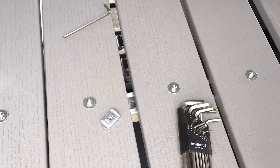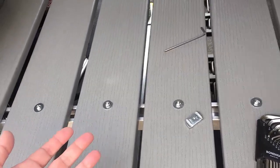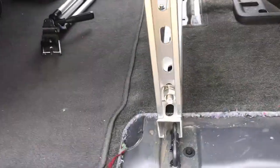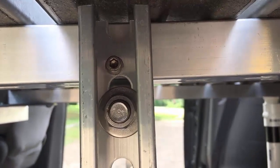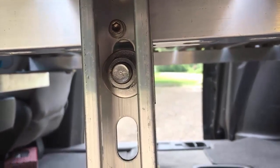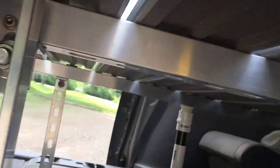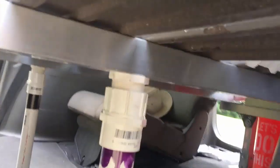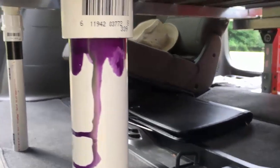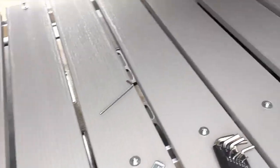You would just set these boards down in place and then tighten the bolts — easy to disassemble. I can stack all these components on top of each other so they don't take up much space. I folded the Unistrut frame — I made one modification where I have an extra screw on top through a drilled and tapped hole. That way I can lock it into place so it's not going to rotate. But when I store it, I take out that screw, push on the leg, fold it up under the frame, and store it against the wall. I still haven't gotten around to making it look pretty after eight months — but someday. It's functional and it's durable.